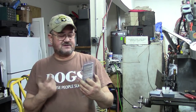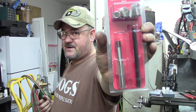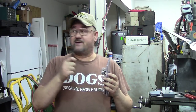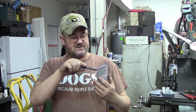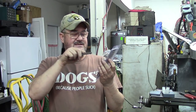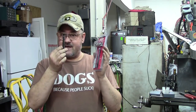We haven't done any of it yet. This is a new set that I've got. Helicoil — you can pick these up at your O'Reilly's parts store or wherever, that's where I got this one. The drill bit size — I've already used this once before so the drill bit ended up in my collection. I always keep all my drill bits. It actually says on here: drill diameter size is 25/64ths, or .391 thou. The package will generally say that. If you get one of these used and it has the tap, has the inserts, has the insert driver, but doesn't have the bit, you can look on the package or internet.